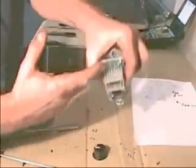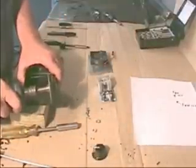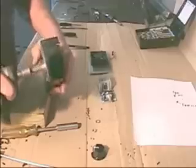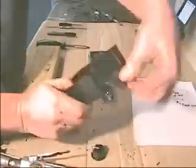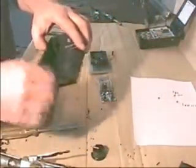We're going to cut the complete back end of this box out. Why? Because you have wires that are going to connect onto this pulse width modulator. We're going to trim that out right now with the cutter wheel. We're going to cut like this and just take that right out of there. Be careful — this is hot. You can trim it with a knife, or let it cool and it'll break right off.